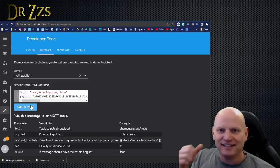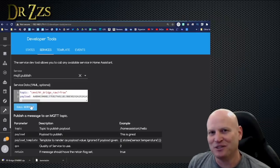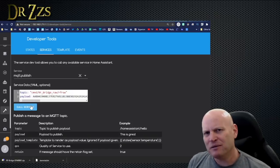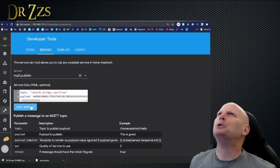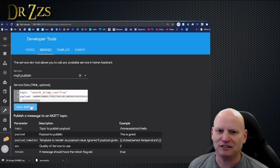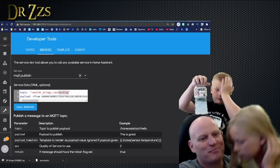I like it. All right, now we have successfully finished. We got the RFBridge flashed with Tasmota. We got it flashed with Portisch. We got the Zemismart battery-powered RF shades motor working through Home Assistant with MQTT. Whoa, massive success is right. Yes. Tired? It's nap time.